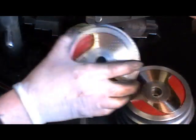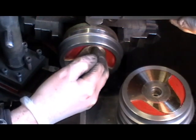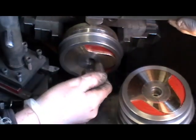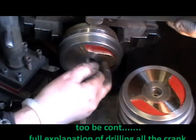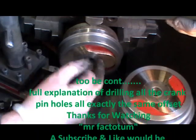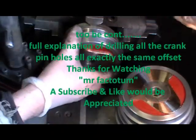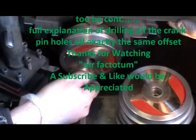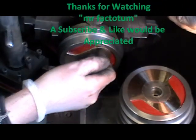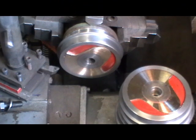Because when my wheels go back in and I get the centre line of this lined up with the hole, I'll have to put a mark on the jig — then my wheel will be running offset and I can drill the crank for the crank pin. Once this jig is set for that diameter of the crank pin, all my wheels will be the same. I've just got to make sure I put a centre line on and get the centre line lined up with the centre of the hole in the jig. So that'll be my next job — I'll catch you on my next clip.